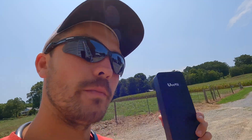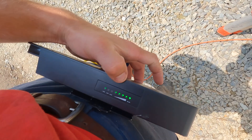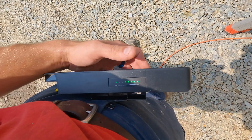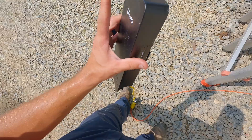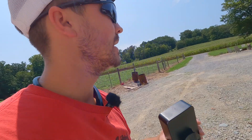You want your master on A, your slave on B. There are lights on the side of the unit — four lights that determine your signal strength — you want those to be as good as possible on both units. The WLAN indicator means we have internet coming from that master unit to this one. So let's go install this one on the barn, plug it into the wireless router I installed yesterday, and see if we have Wi-Fi.